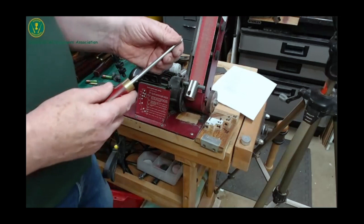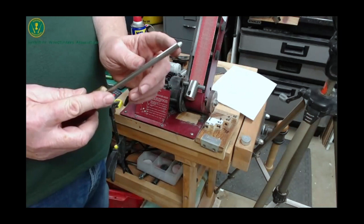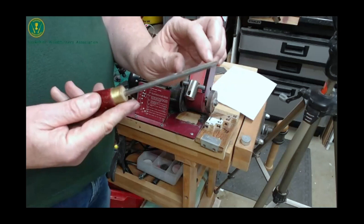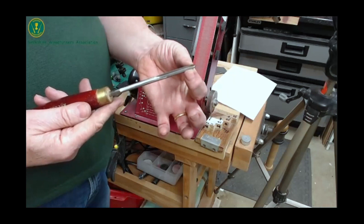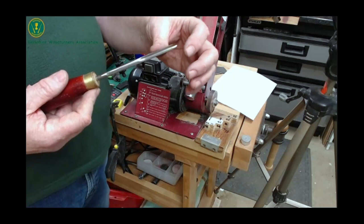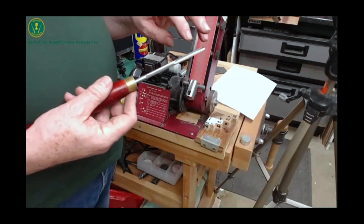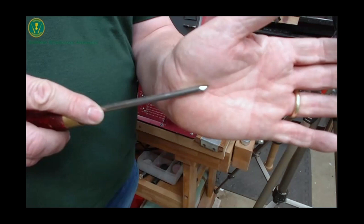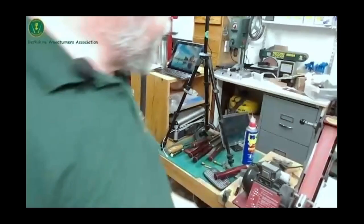There's a leaflet that talks about the short grind and what they discuss is the angle of the grind on the top face. When regrinding a tool, you choose what the top angle will be. You flatten it across the grinding wheel to get your horseshoe shape. When you've got your horseshoe, you grind the outside down to meet it, and when you see no light glinting around the horseshoe shape, that's when you've got it sharp. Sorby suggests grinding the top rake from 45 to 25 to 15 degrees, with the longer grind top at about 15 degrees.